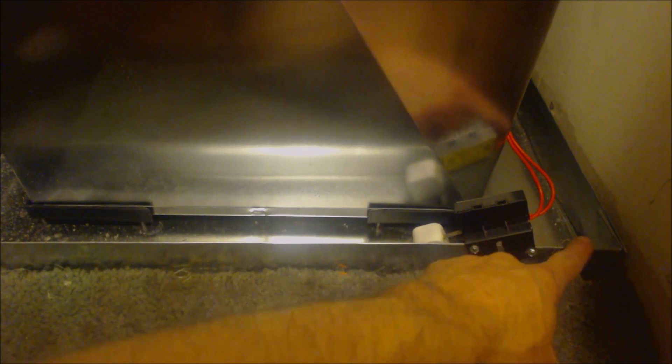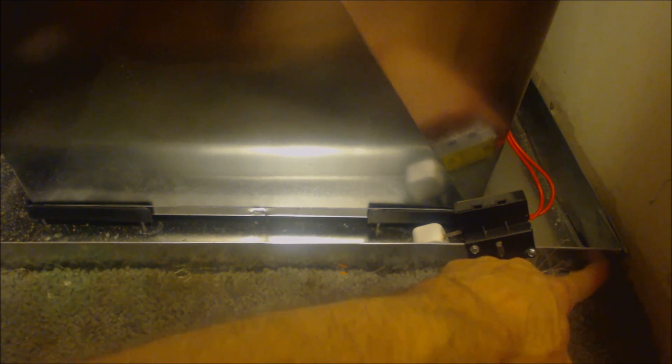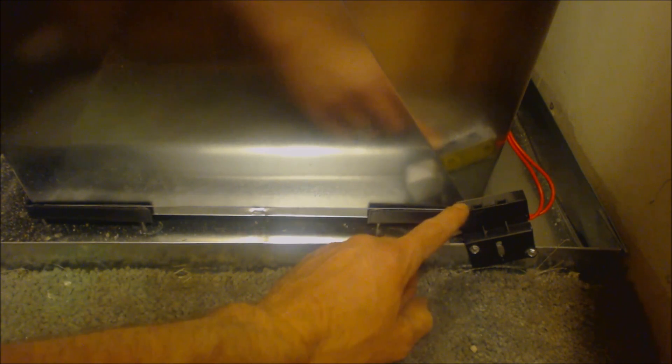If you want to know how I made this pan without cutting or soldering, these edges are all bent. So this pan does not have to be water tested — it won't leak. If you want to learn how to bend that, I have another video on that. I have a link to the SS2 float switch down in the description below. This safety switch is a Hartel safety switch.